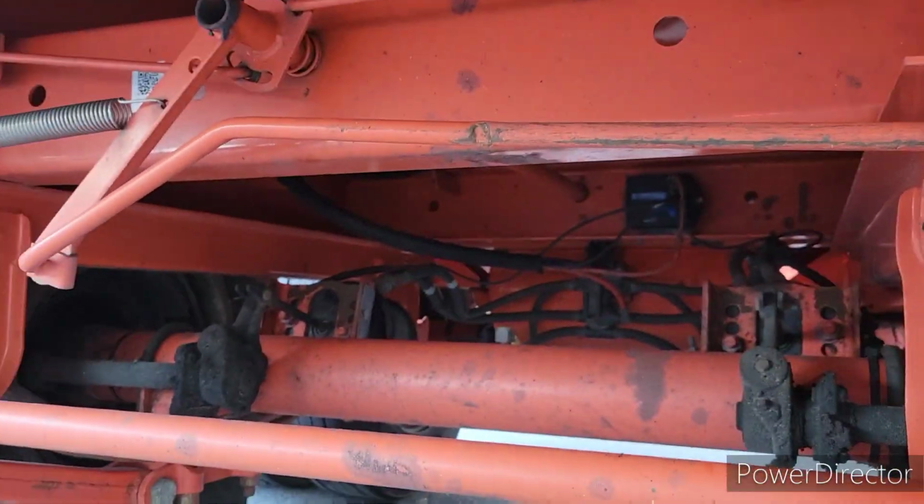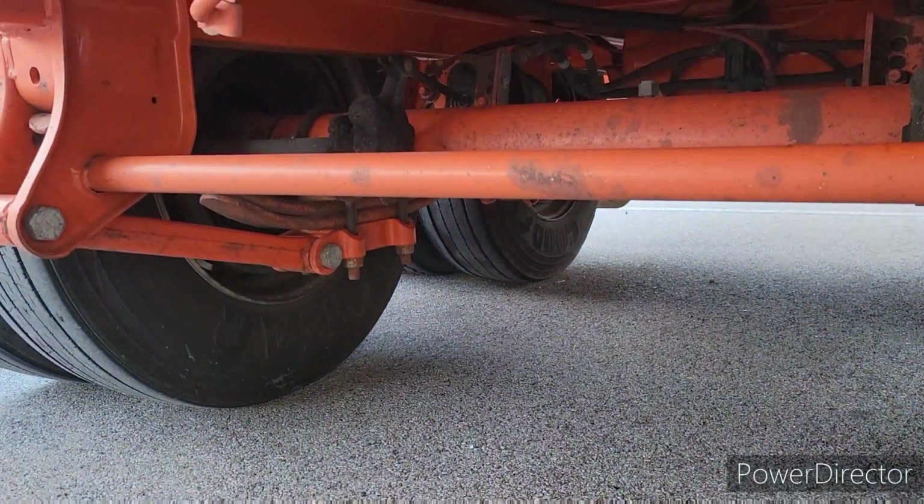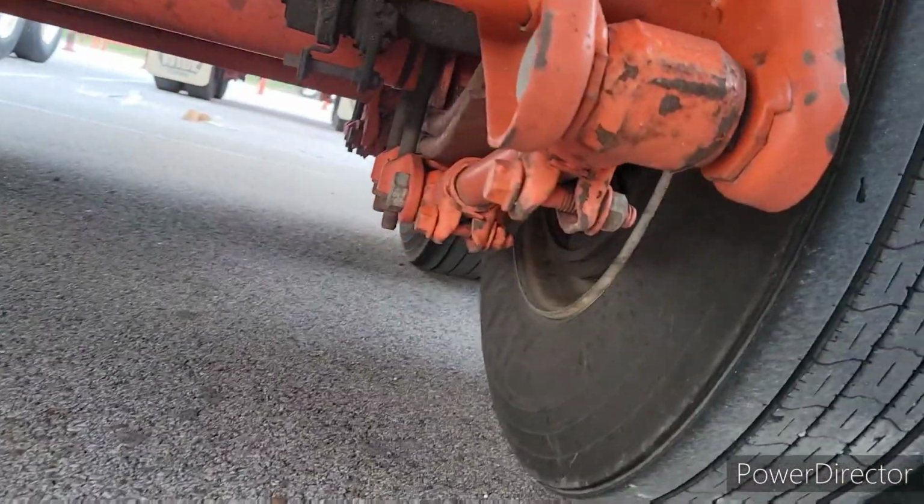You know, look for your brakes, look for leaks. You see oil streaks on your tires under here? That means you've got an inside wheel leak on them. Check them. Check your brakes. Look at your brake pads. Make sure you've got brake pads, not just at the bottom, at the top too. Look in between the wheels.